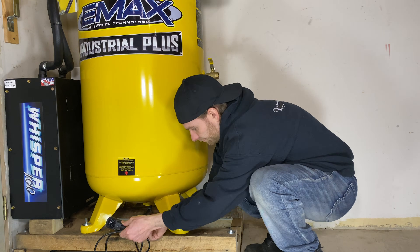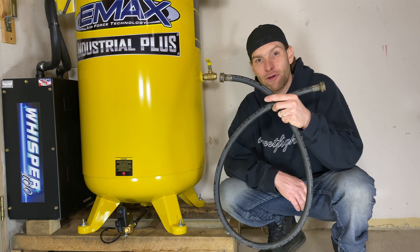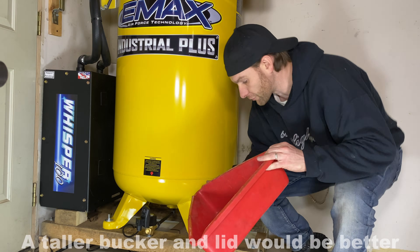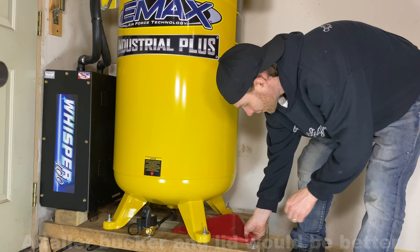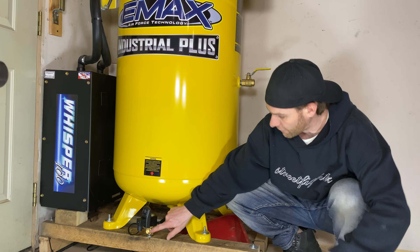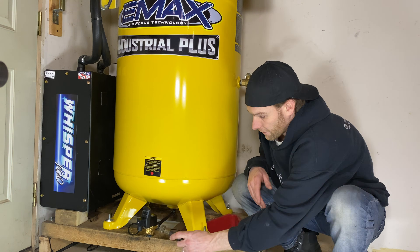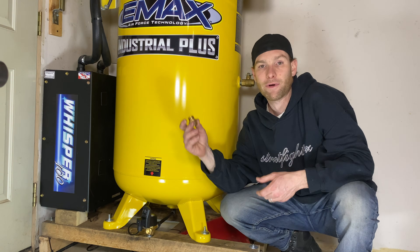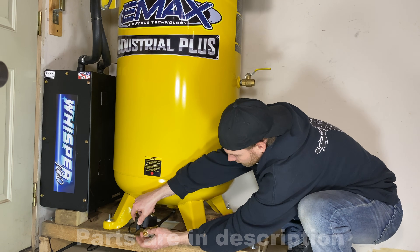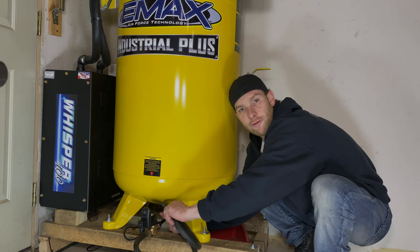This installs by simply screwing it in and plugging it into the wall. I'm going to go ahead and put Teflon tape on my threads just to keep it airtight. Whether you have a manual drain or an automatic drain valve, you still want a hose to direct which way the water drains out. What I'm going to do temporarily is just a drain pan — I'm going to put that here for now. Eventually I do plan on having it go outside. But as you can see, it only has a female half-inch hole on here, and you're not going to be able to fit the hose on there. So I went ahead and bought a half-inch to three-quarter-inch adapter that's going to screw on here, and then it's going to let the hose screw on. Then put your hose into your drain pan.